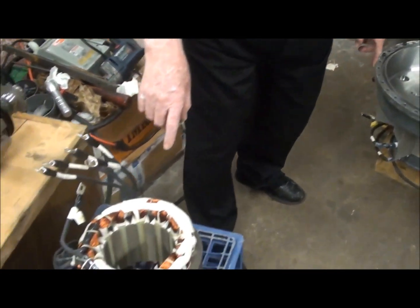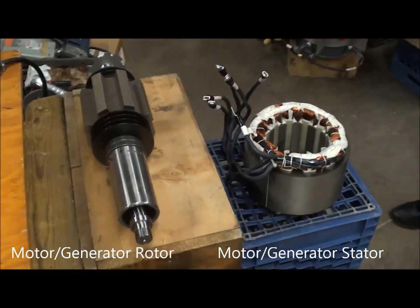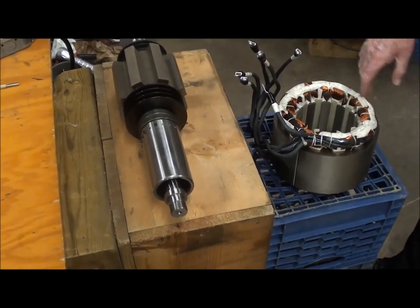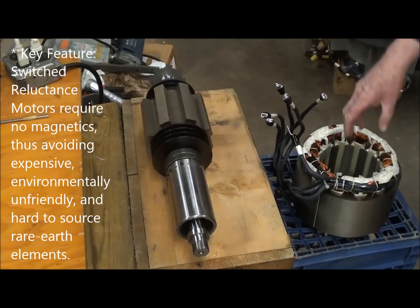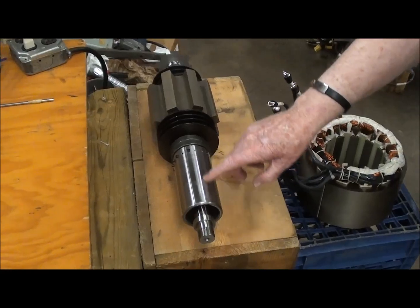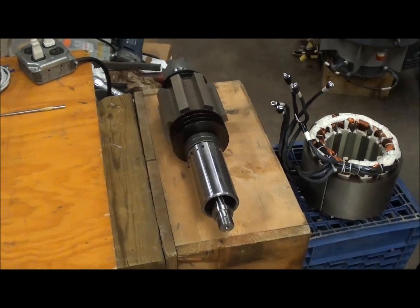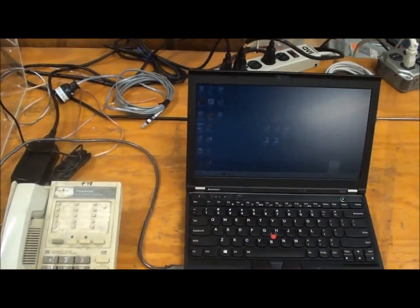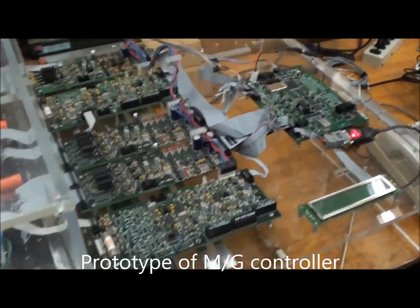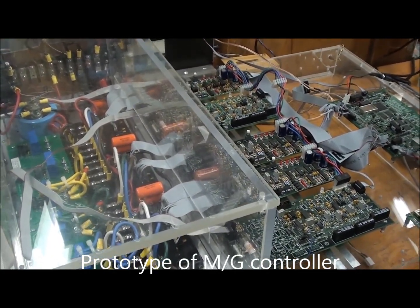Another motor is shown over here — this is the stator mounted inside the bottom half we just looked at, on the shaft, with the rotor of the motor here, a switched reluctance motor. This is the cylindrical lift-off surface I described to you just now. We run this with a computer that senses the position of the rotor, drives the rotor, and gets energy out of the rotor as well.